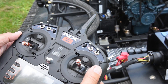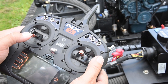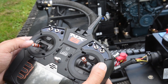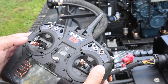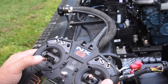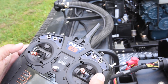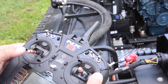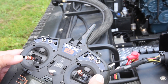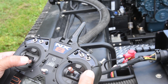Once the machine is started, the left stick — if you hold it to the left, it will rev the engine up. If you hold it to the right, it will rev the engine down. If you want to go up just a couple hundred RPMs, you do one quick bump. If you want to raise a few hundred to a thousand, you just hold it until it is where you want and let go. To the left is rev up, to the right is rev down.